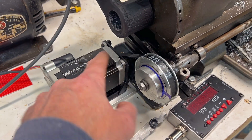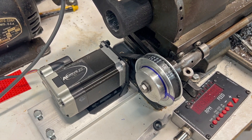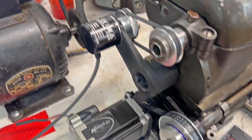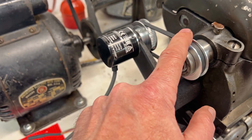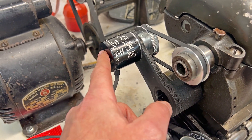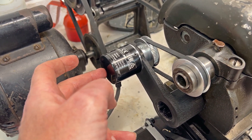In the software I've configured it at three times eight, so 24, because there's a one-to-three gearing going on here. I have an encoder up here that is one-to-one connected to the spindle with these pulleys. This is an 800-resolution encoder, which translates to 3200 steps on the encoder itself.